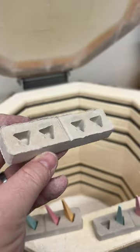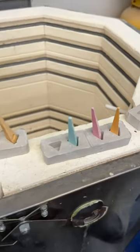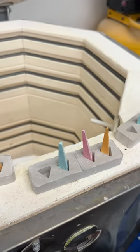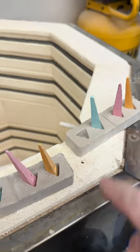These things are a lifesaver. We never spend the time to put them into clay — just put them into the pre-made cone plaque and they're at the right angle and they're ready to go into the kiln. So remember, the dot faces the bending side.